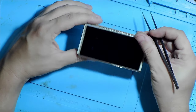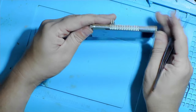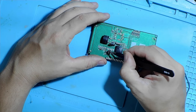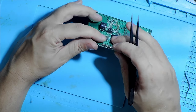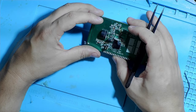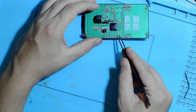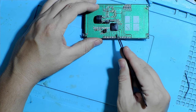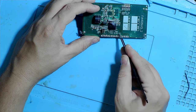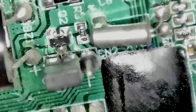We also have to figure out what everything is because there are multiple connectors and markings. The board itself seems to be in okay shape - it's an old style LCD display and it has some interconnects on the side. If you get a garbled picture, this is the first place you have to look. Nothing was connected to it when I opened it up, so the power is probably on the ripped connector, and yeah it says it on the board: power in.